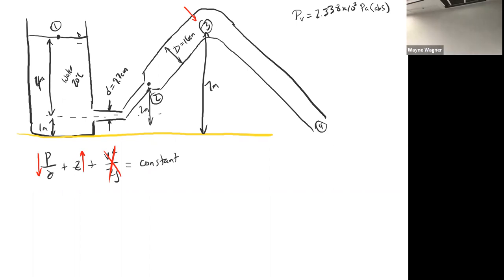So it's really just hydrostatics, except it's not a static fluid, right? So as you move upwards in a fluid, it tends to get less pressure. Now, if you're over here, you're never gonna cavitate, because by the time you get to gauge pressure, that's where you get to atmospheric pressure and you're in the atmosphere. But if you're in a siphon, you can get pressures that are below atmospheric. So you can get below zero pressures.